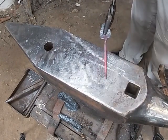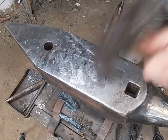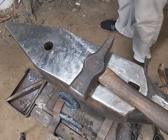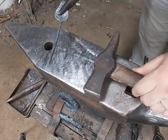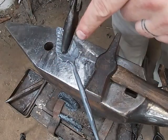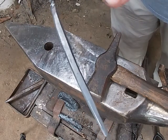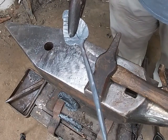Raise your corners up. Be careful right up here close to your leaf so you don't smush it or mess it up. Angle your hold — corners up, hammer the corners down, then work it around. I don't make my stuff perfectly round; I leave it textured because I want it to look handmade and like a piece of nature. Nothing in nature is perfectly smooth.